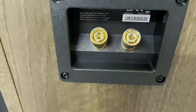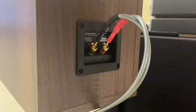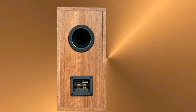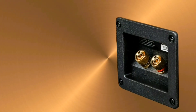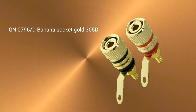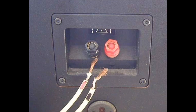On the rear side of the cabinet there are binding posts — positive and negative terminals. These are gold-plated binding post speaker terminals for cable gauges of 12 to 18 AWG, with contact spacing of 92 mm × 79 mm. This bookshelf speaker has only one pair of terminals, so it cannot be connected with bi-wiring or bi-amping. Be careful when installing these speakers to ensure no stranded wires touch each other.